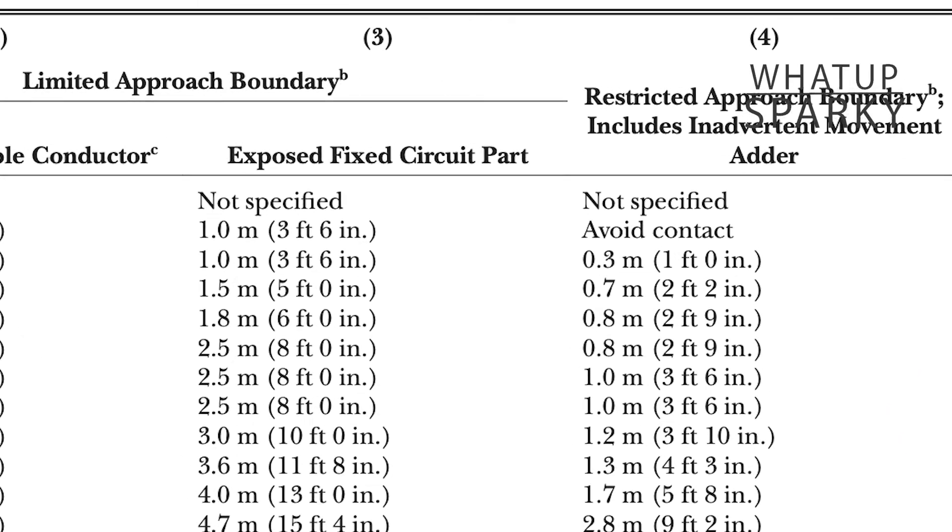The first of those three things is the nominal voltage. That nominal voltage is going to tell you what to expect inside that cabinet. If you have a tester that's good up to 600 volts or 1,000 volts and that's what you're trained on, but this particular cabinet also has something in the 12,000 volt range, well if you're not a qualified person to work on that voltage, then don't even open the cabinet. Having that nominal voltage there gives you that warning and you'll know what to expect. The other thing it does is it actually provides information for you to follow your restricted and limited approach boundaries. You can go to the table and based on that nominal system voltage, you can know what the appropriate restricted approach and limited approach are. You don't actually have to have those shock hazard boundaries on the label — you just have to have the nominal system voltage.